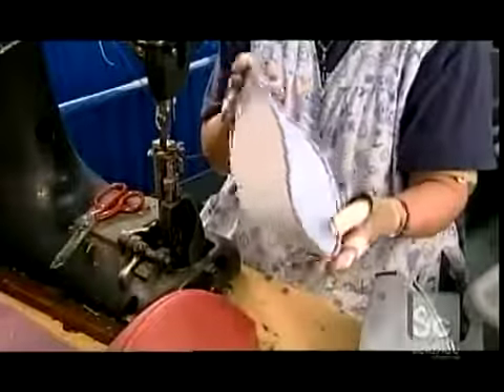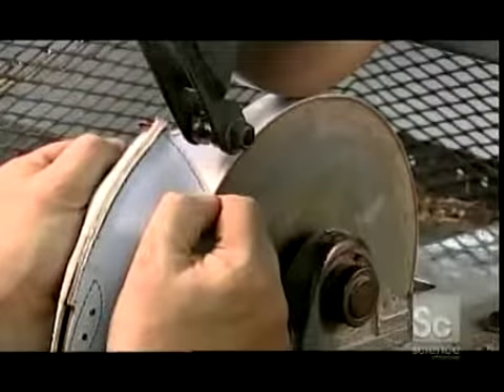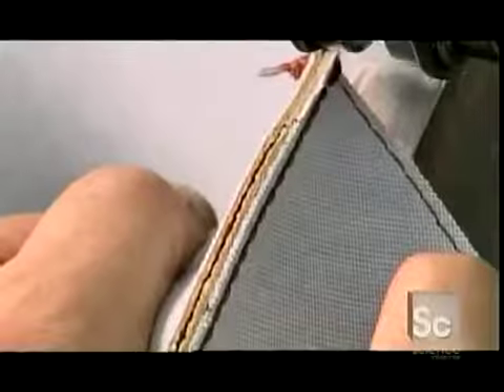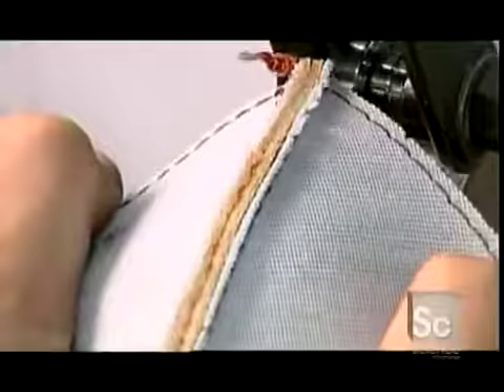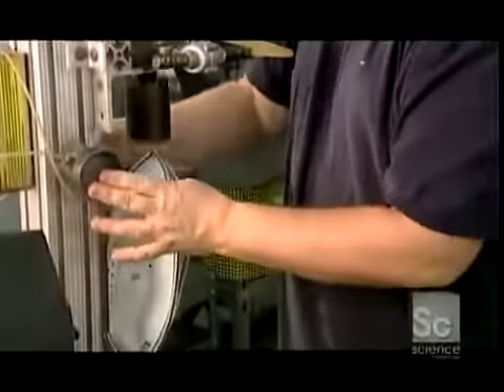It's important to flatten the four seams. To do this, a worker places each one on a wheel as a roller passes over the top — this keeps the ball from being bumpy when they stretch the skin over the bladder. A 15-second steam softens the leather and makes it easier to manipulate. Then a concave press flattens the seams at the tips, which also keeps the ball smooth when inflated.